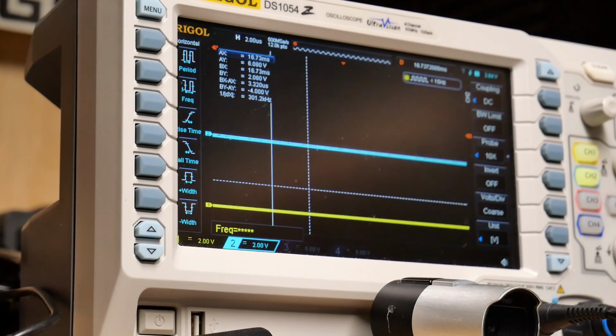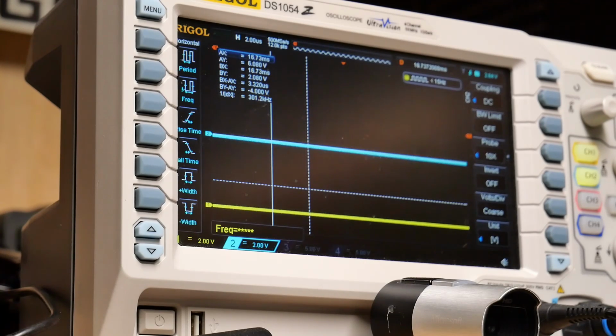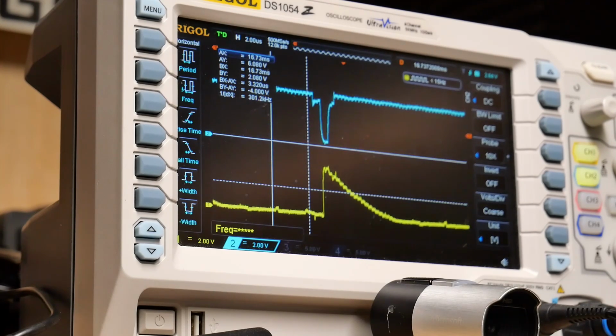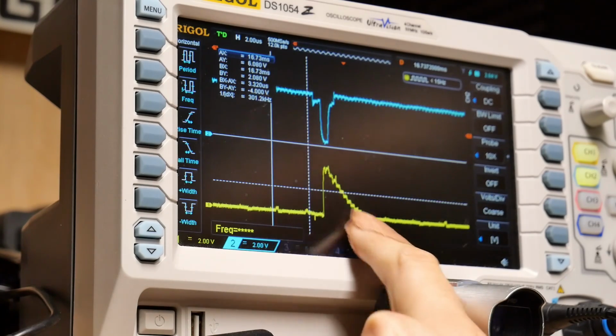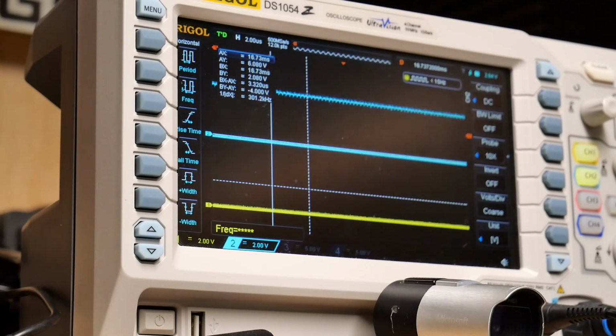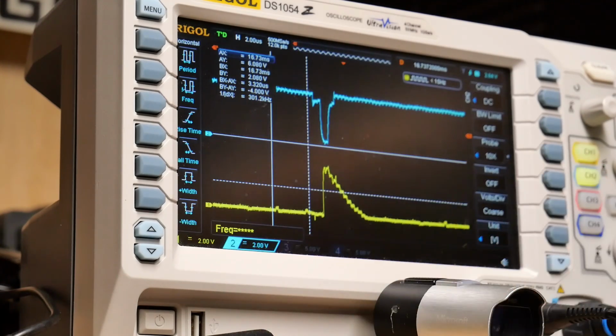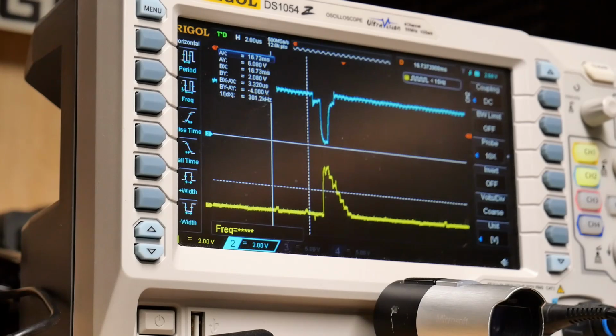Let me turn the power off and back on. See that behavior? Something's very wrong there. That's not normal. This right here is the ROM driving the bus high, but then what is this weird taper, and why when I turn on the computer does it slowly drop down? And it's very stepped as well, which I'm thinking probably coincides with the clock cycles into the CPU.